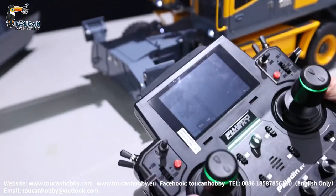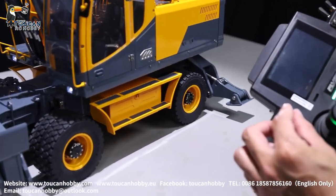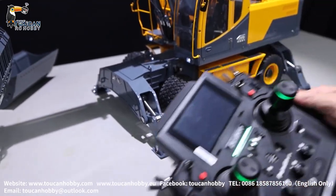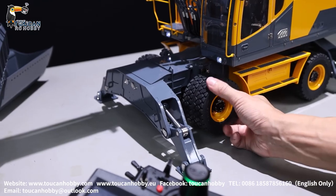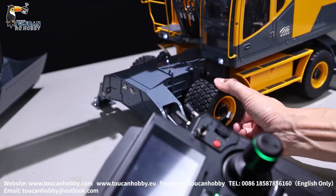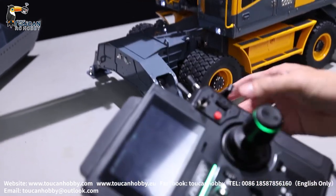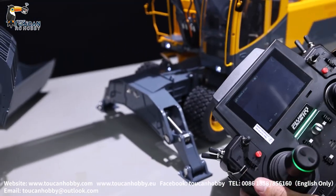Channel 15, start the pump — SWB, that's the rear side standing legs. Channel 16, SWD — that's the front leg, already standing. Now it's moving by hand — suspension can roll. Lock SWC — it will fix. In the middle, the valve is closed. Oil cannot go from left to right. Unlock it. That's channel 14, SWC, for locking the suspension, stop rolling.